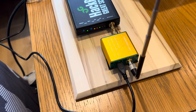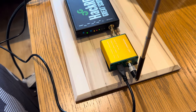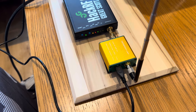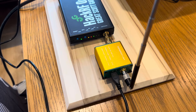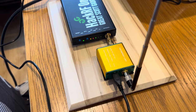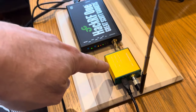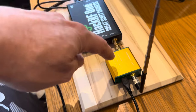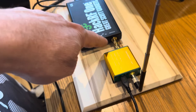So first of all, we've got the HackRF1 connected to the computer via USB 2 — surprisingly not USB 3, but USB 2 is all it needs. It's only half an amp's current consumption, which is amazing. On my initial tests I discovered that using it at a high transmit power it wasn't liking it — at about 30 dB without the high-power option enabled, the signal was fading a bit. So out of an abundance of caution, I bought a low-noise amplifier that operates from 0.1 MHz up to 6 GHz, boosting the signal by 20 dB.